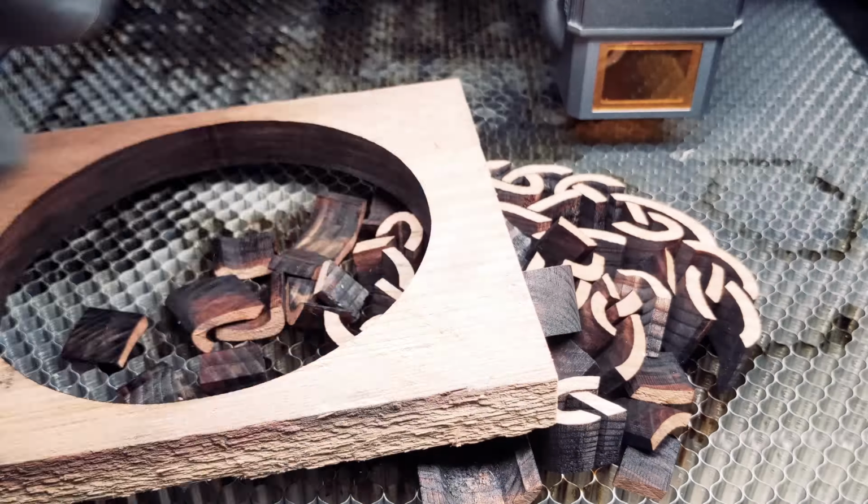One of the questions we get asked often is, when you're cutting or engraving black acrylic, why don't you just leave the plastic since it's just a clear film? As you can see in this 3mm black opaque acrylic, if you engrave it with the film on, it's impossible to tear it off cleanly.